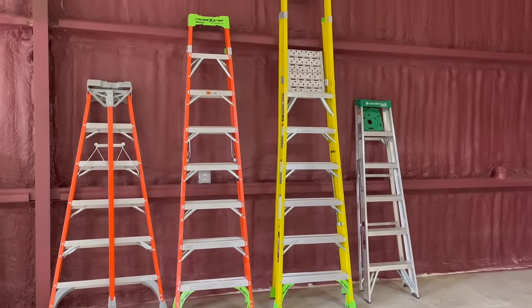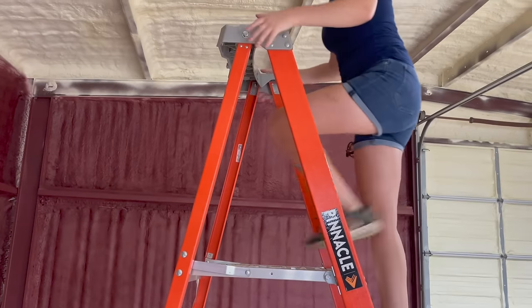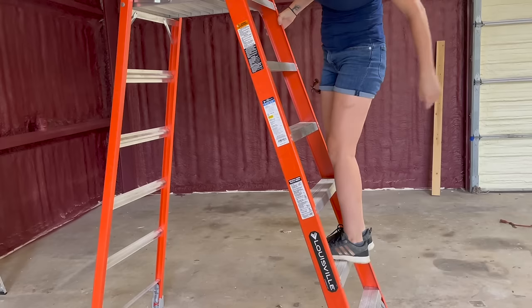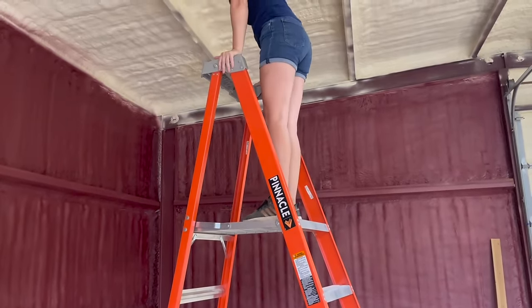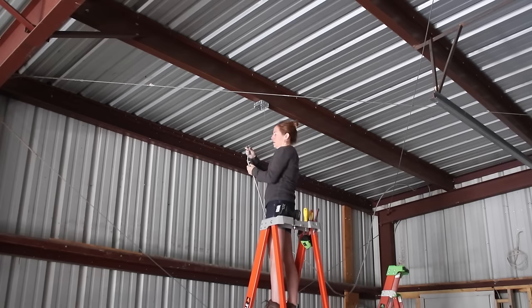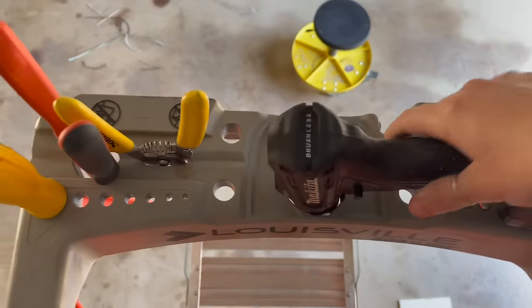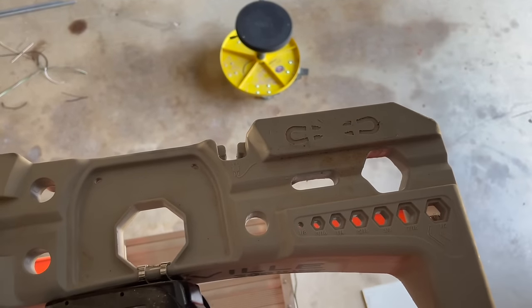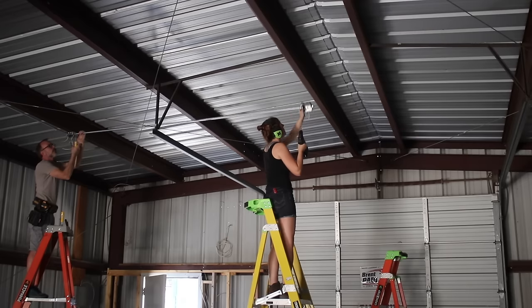One of the biggest assets on wiring day is having an assortment of ladders. You already met my new best friend, the three-legged ladder, but for ceilings my new favorite recommendation is the Louisville platform ladder — this one is called the Pinnacle. Do you ever feel like you have crow's feet at the end of the day from being on a ladder, where your foot's curling? Not with a platform. Not only does this platform create comfort, but it also creates a safer work area. Turning from facing forward to backwards on a step is a no-no, but on a platform I can 360-turn around, especially since Louisville has the top curved out so your body has room to rotate. They also outfitted the top portion with tons of function — plenty of room for tools, a paint can, and even a magnetized area for hardware. Down on the bottom you have boots that are non-marring and create a secure slip-resistant footing.